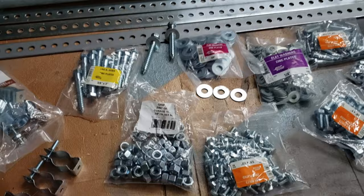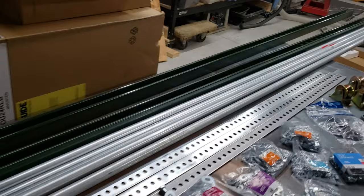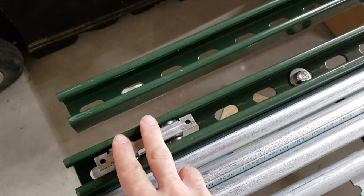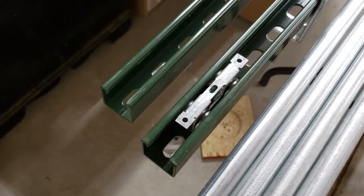First let's take a look at the ingredients. I've got some nuts and bolts and random hardware, and I'm going to use these clamps and rollers later in the project. I've got these metal strips with holes, some three-quarter inch conduit, and also this unistrut. The unistrut, along with this nifty little roller, is kind of the key to making this thing adjustable. I thought I'd be able to bolt it directly to my bracket, but the bolt head gets in the way of the roller — so I found special brackets specifically for mounting unistrut, and the roller just slides right through.